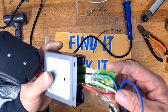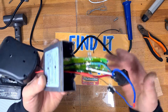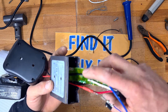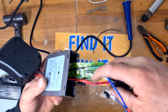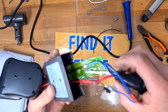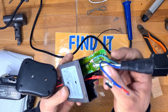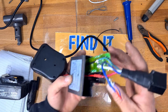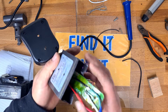With all the solder joints now finished, we've got the switch switching the coil in the relay. Ground goes to the switch side of the coil, live goes to the live side — that's the switch and that's the coil, with the coil triggered by the switch. That's the soldering part all completed.